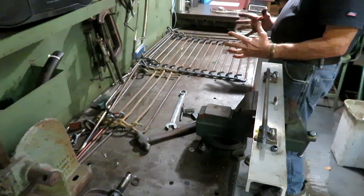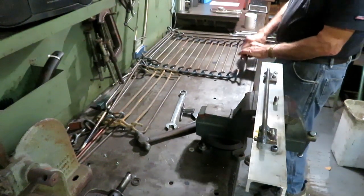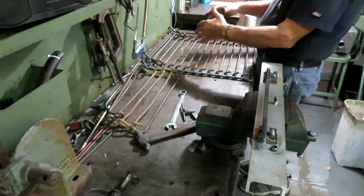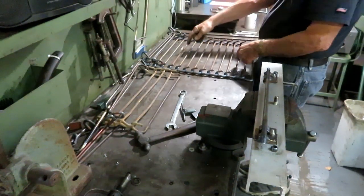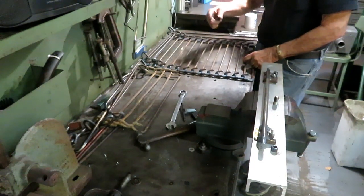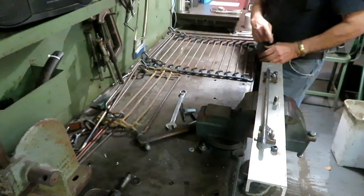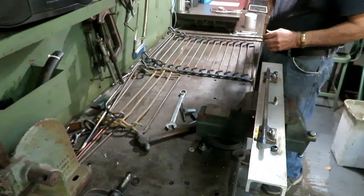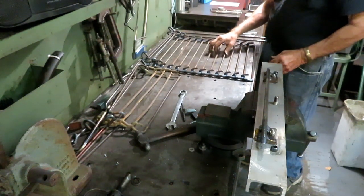The sprockets that this goes on are really worn and big and loose, and the tolerance isn't that tremendous. But this conveyor runs over the sprocket. The plow's got a double V in the front and some other hooks and things. They pull it behind two horses, and it digs up the potatoes and shoves all the dirt toward the back, and it runs up this conveyor, and there's an oval-shaped sprocket that runs like an idler against it in the middle of the run, and it makes this go up and down. It shakes the dirt out between the bars here, and then it goes around the drive sprocket on the bottom, and comes back. And the whole thing is about 8 feet long, and it's going to take about 64 of these, so it's going to be a while.